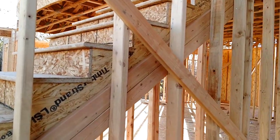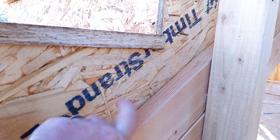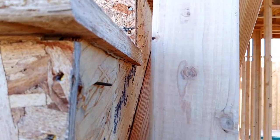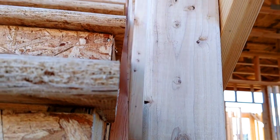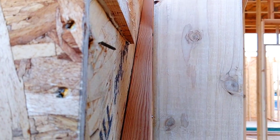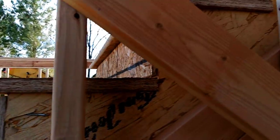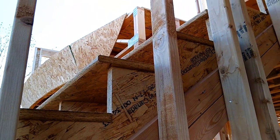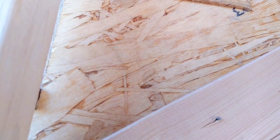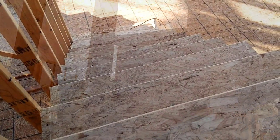Here's a side view of the steps. We always nail a regular 2x4 onto the bottom of the risers. The reason we do that is so when you're trying to get your drywall in here later, you can slide it right down the gap between the wall and the steps. It makes the drywall look a lot better and much easier to install — otherwise you have to notch it over and up all the way up the staircase, which makes finishing those corners really difficult. So put that 2x4 right on the bottom of the riser.